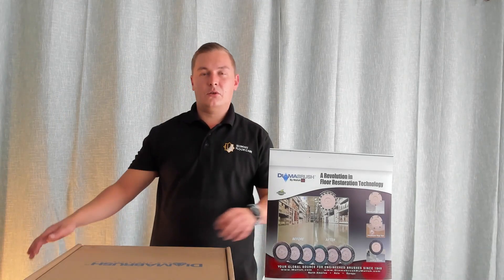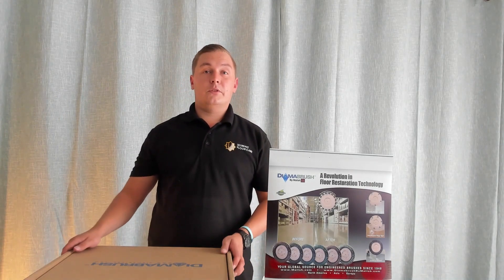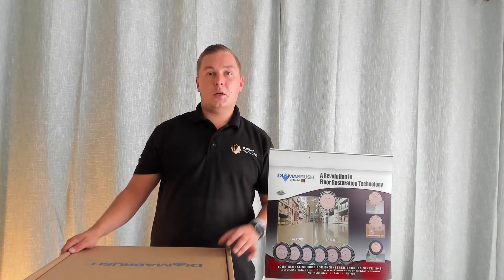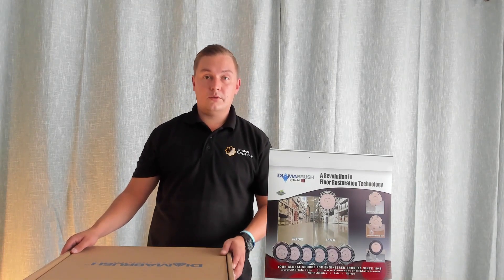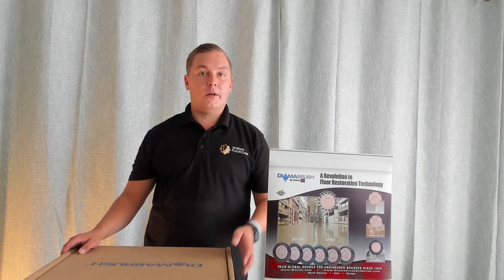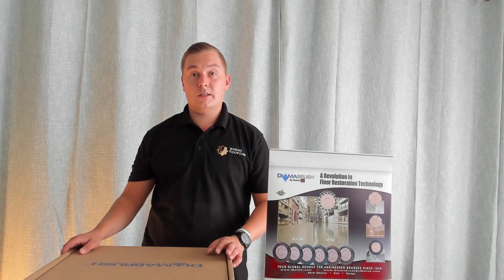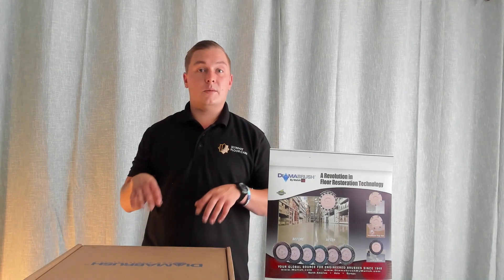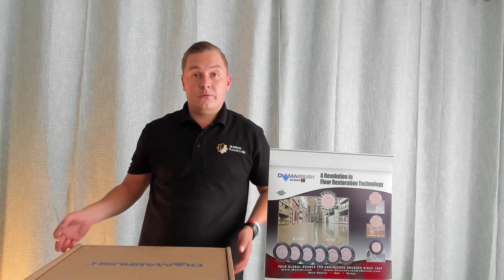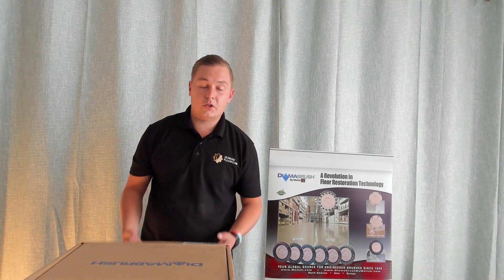In this video we're going to be talking about the diamond brush hardwood tool. This tool is used for removing very stubborn coatings on hardwood such as oaks — we're talking carpet adhesive, lino adhesive, anything that's been put on top that's really difficult to take off with an abrasive. This tool has been made to make it easier, so it's chemical-free stripping and it works with impregnated diamonds.